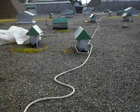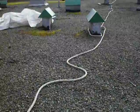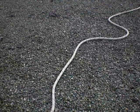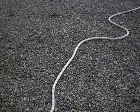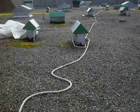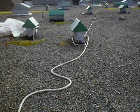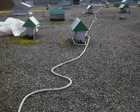That way the fall is broken by this, and then when that gives up or doesn't hold, then you have a tiny little fall. Because initially, typically when you fall from maybe 7, 8, 9, 10 feet, maybe even 15 feet, hopefully not that much, but roughly 10 feet, you're falling, and then the rope catches, and that's a lot of shock loading. That's dynamic loading, right? So this slows down, cushions the whole impact if it were to happen, and therefore there's less G-forces, less load on the rope, less load on my body, and that's basically how I like to have it set up.